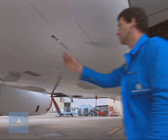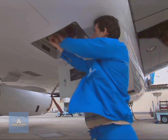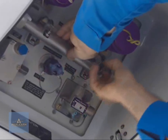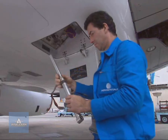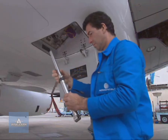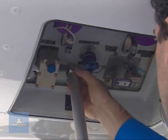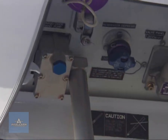The second operator opens the yellow ground service access panel. Unlock the hand pump control handle quick locking fasteners. Pull out the hand pump control handle and set it in the operating mode. Install the hand pump control handle on its pump.